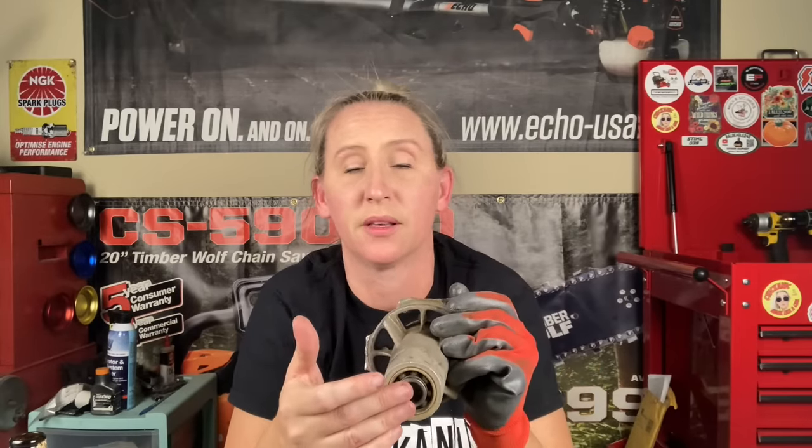Although it's still a sealed bearing on the bottom, they did put a spacer inside of the bearing, so you do not have to worry about putting a spacer before you put your pulley on. We tell everybody we sell a spindle to, make sure to put the spacer underneath the pulley because they will destroy the entire spindle the first time they run it if they forget. It's a little crazy that they actually listened and made it so that it can be greased. So guys, it's time — it's time to start greasing them. Grease it up. I went ahead and double-checked to make sure this was correct and nobody had just swapped it out. I looked up the model and all the parts, and yes, this is the replacement for it — it is a greasable shaft. I also looked up brand new Husqvarnas being sold at the big box stores now. They have the exact same shaft. Like I said, I don't see the stuff until it starts breaking, and that's why I finally know about it. But now you do too, and hopefully this will save you some time, money, and frustration in the future.